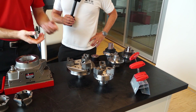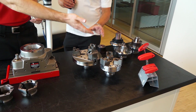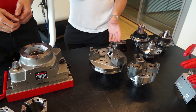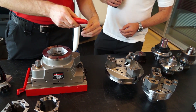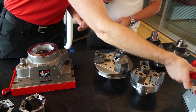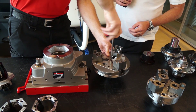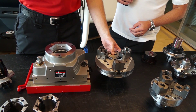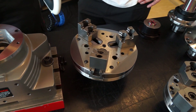They are basically jaw chuck adaptations. So if we went for the bigger one — here we're demonstrating that we've gone from maybe a 65mm bar up to, what's the diameter here? Up to 210. These jaws are for diameter 170 at the moment. I just use the wrench to move the adaptation to clamped position. I check here the indicator pin.